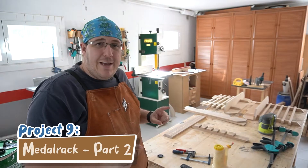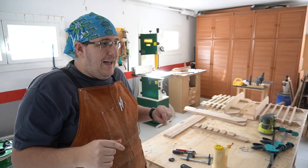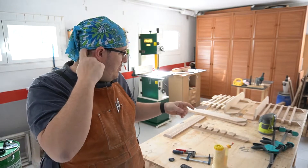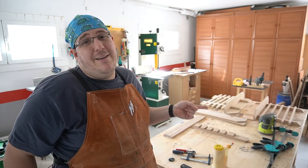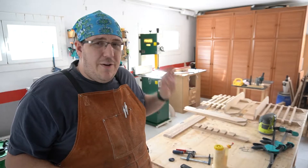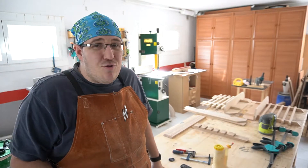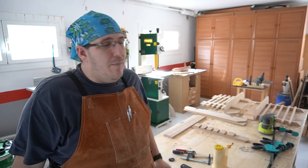Finally, that's done. Hours and hours, days and days of sanding — I literally ran through two batteries sanding each piece. With hardwood, you have to work your way up through the grits. My orbital sander is dying, and a little advice: if you ever buy an orbital sander, buy one that plugs into mains, not battery-powered. Batteries don't last long enough and the big batteries make it really heavy.